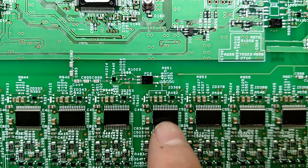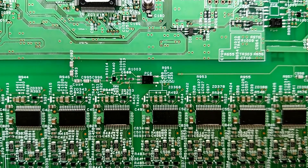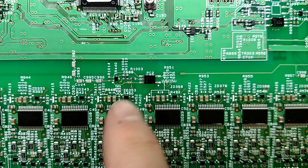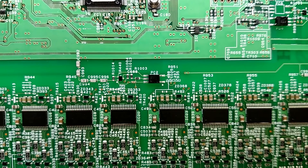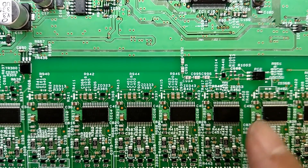There's another optical isolator coming out of the chip on the bottom, and its output goes to this chip here. This is so they can pull the main disconnect fuse, which is actually located in the middle of the battery pack. If they didn't do this, you'd have a lot of current flowing through the little trace that connects the two together, which would be really bad. They optically isolate that, and we can use that to our advantage because I need to split this thing in half and remove some cells.